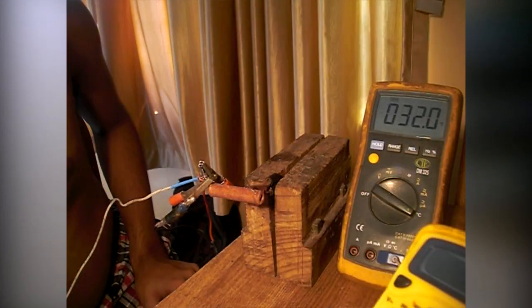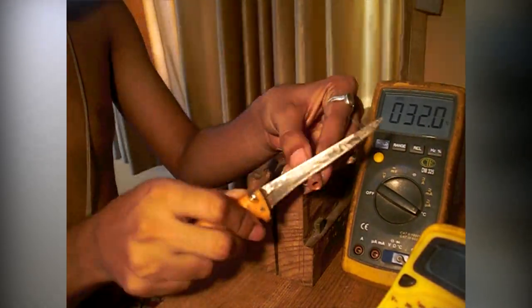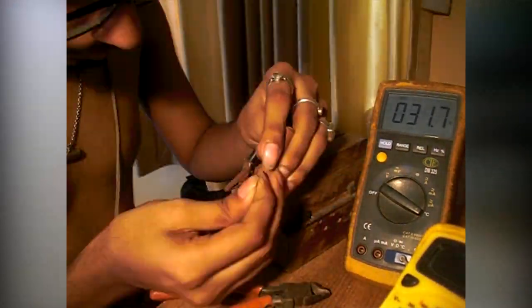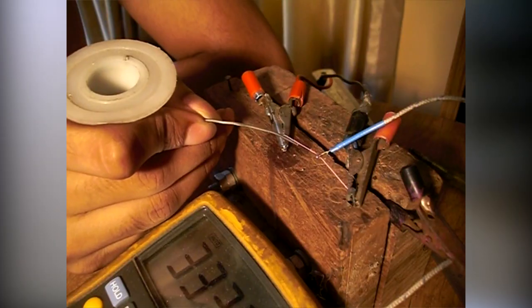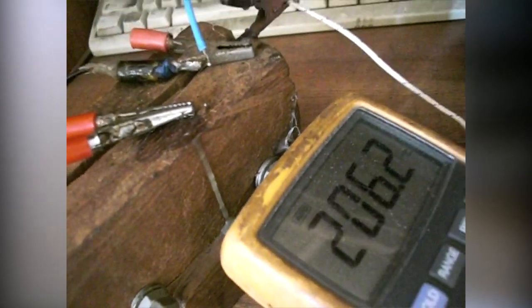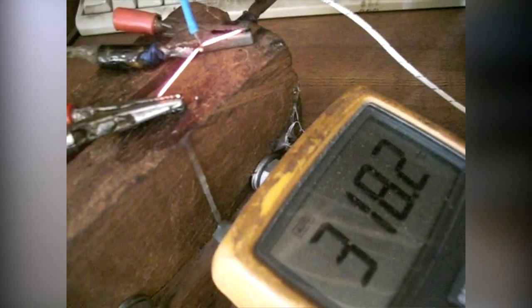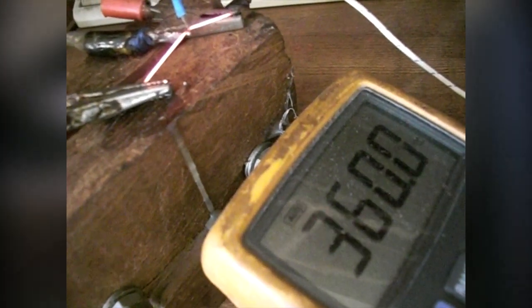Thankfully I have some 10-watt wire-wound resistors. I opened them up to extract nichrome wire, which is used in most heaters. I kept unwinding the nichrome wire and after choosing a workable length, it finally worked — and it heats up quite fast. While testing, I also realized that airflow from my fan significantly reduces the temperature.